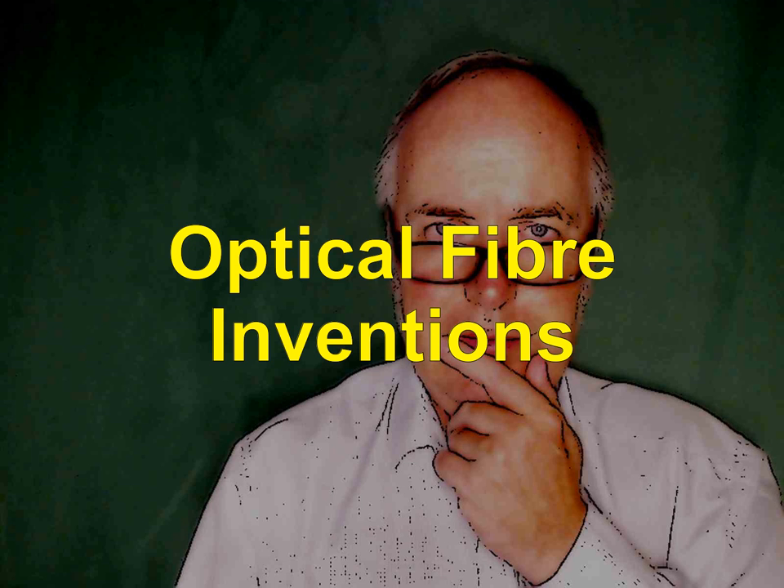It's a light guide. You've got a core on the inside and cladding on the outside. It's really best treated by wave functions — there's a wave function of light across the very centre, and that wave is like an atom: it can have a stable orbit of light in it. This is a single mode optical fibre. At lower index you can have cladding modes, so you can launch light down the core, and also for a short distance down the cladding. The core is generally about 10 microns across and the optical fibre is generally 125 microns across.